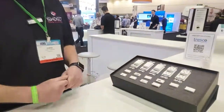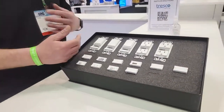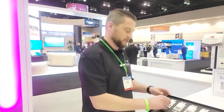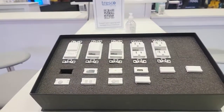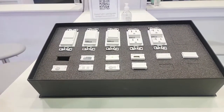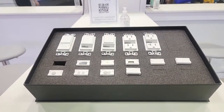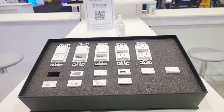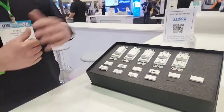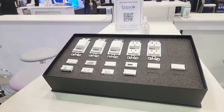The name Swidget references both switching and widgets. What they have are a series of smart home products — wiring devices primarily — that are modular in design. The cavities in these products allow you to interchange different modules by a simple snap to click into place, giving you different capabilities and functionalities. Each insert is a wirelessly connected device. When installed into the wiring device, it gives you control, the ability to see energy used by the device, plus extra features like an IAQ sensor, motion sensors, standalone temperature sensors, nightlights, emergency lighting, and USB charging.